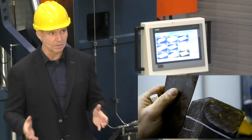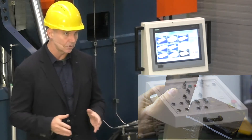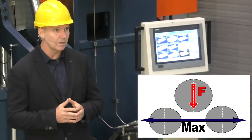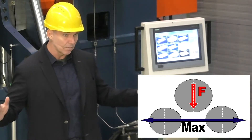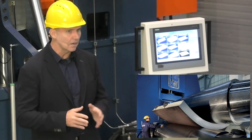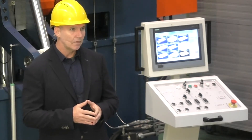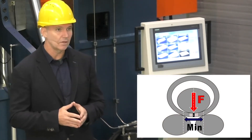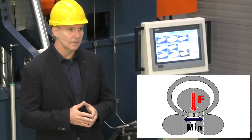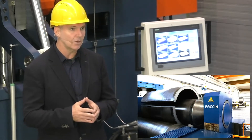The traction of the metal plate and the quality of the pre-bending are exactly equivalent to what can be obtained with four-roll machines, considered by definition the most precise and easy to use. In addition, the enormous rolling capacity obtainable when the distance between the lower rolls is at its maximum makes it possible to have a very highly performing machine, ideal for medium-heavy rolling operations. Finally, if it is necessary to calibrate the ferrule after a longitudinal welding, the minimum distance of the lower rolls guarantees the best accuracy and very tight circularity tolerances.